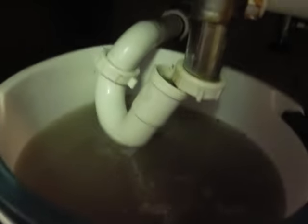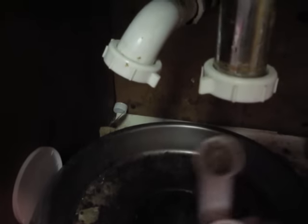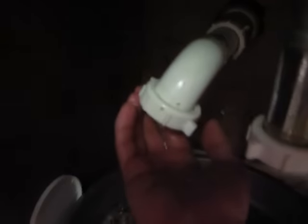I made sure I had a big enough bucket to accommodate all the water. I can't take this bucket out until I unloosen this part. I'm just removing the P-trap right here. And now inside is the blockage. I removed the water, dumped it, and put a pan underneath for residual leakage. After examining the P-trap, it's still a little grody but wasn't the cause of the blockage — you can feel with your finger that the blockage extends farther in. There's a compacted wad of material, so I'm hoping it'll end at this next joint, which I'm going to unscrew next.